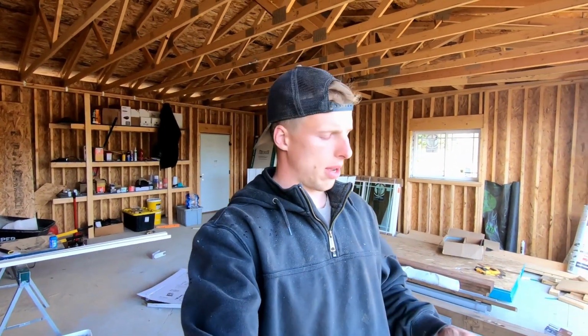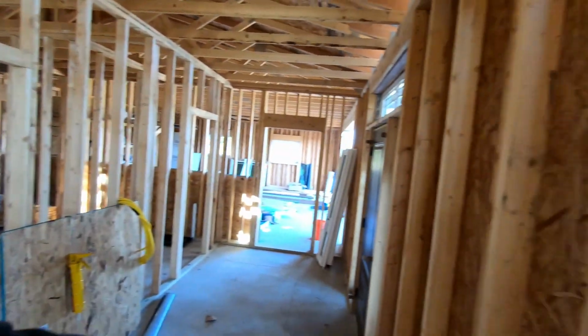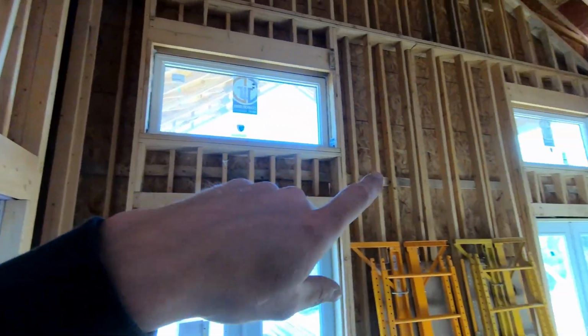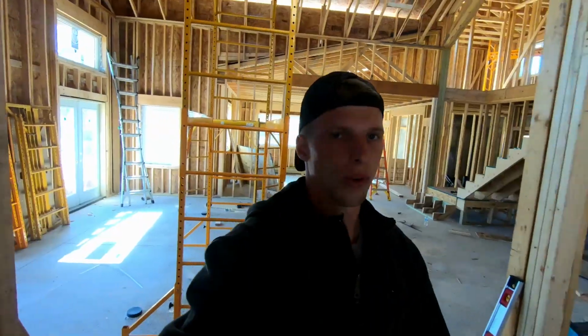Okay, I did a few things on the roof just to tie up some loose ends, so that they can go ahead and get started with the roofing on Saturday. And then I went ahead and kind of tied the front door covered patio roof area. I tied the rafters down to the beams, and then kind of tied the beams to the house where I have the beam pockets. And you wouldn't really know what that is. I mean, they're up there in the corner, the beam pockets, and I use very, very large Simpson Strong-Tie structural coated screws, some 8-inchers, to attach those beams to the house securely.